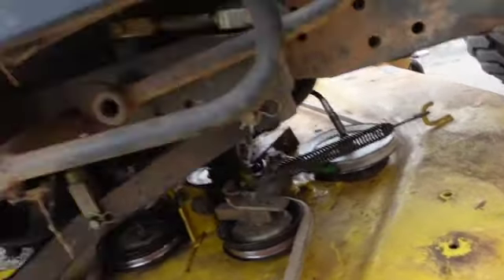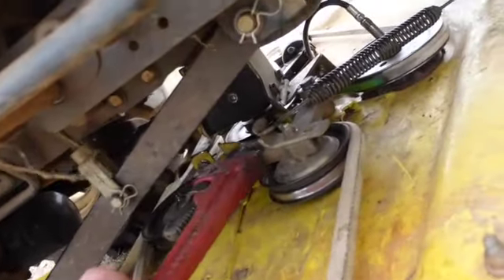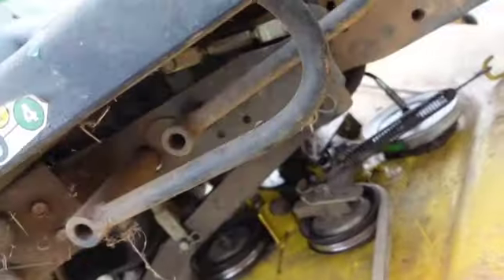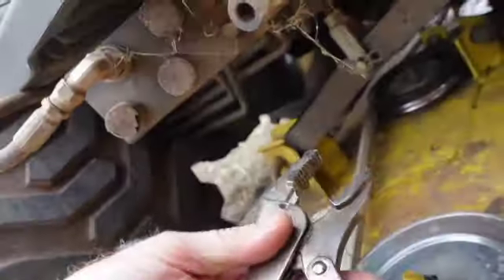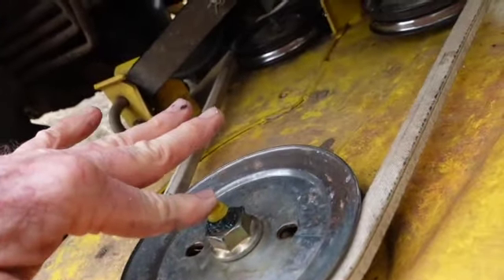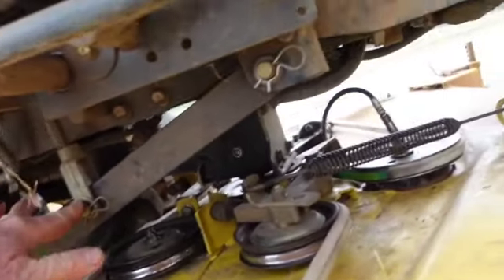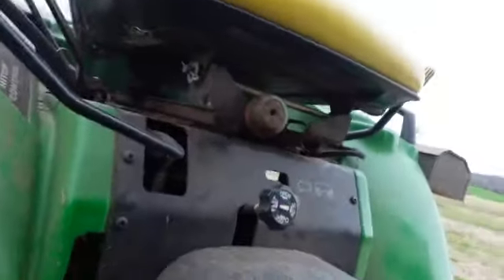This thing's tough. You can't use your 13mm wrench to get this spring over - you've got to get a pipe wrench and a piece of exhaust pipe and spring that thing over, and it was everything I had to get that spring on there with the original vice grips. I got three shots of grease in there, the other pulleys are okay, I got some clevis pins back in there, and I see some stuff I've got to tighten up. My gosh, it's almost 2 o'clock.